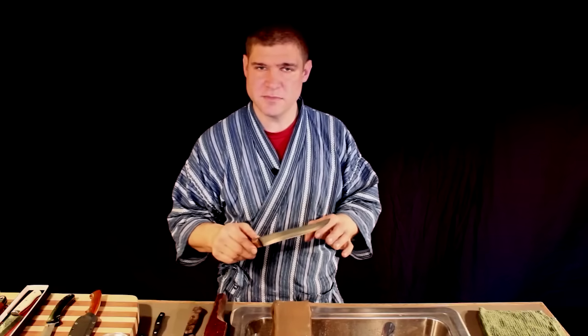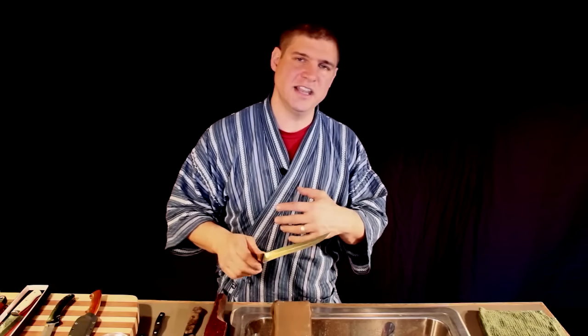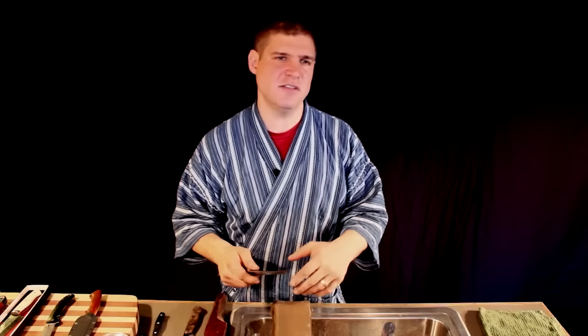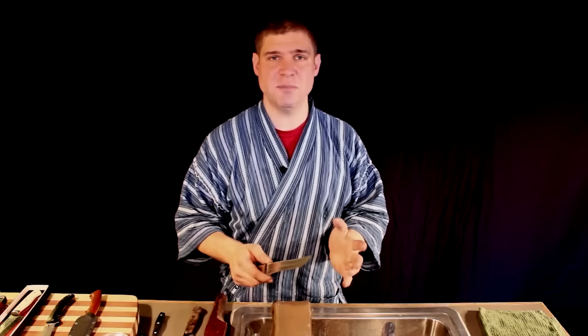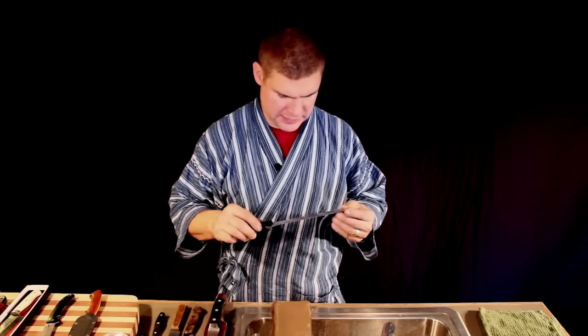Now, if they're minor chips, you can just be assured that with repeated sharpenings, you'll eventually get the chips out. So you might not feel like you need to get the chips out in just one session of sharpening. You might think, well, by the time I've sharpened this blade the third time, they'll be gone. In the case of really severe chips, where it's actually going to impede, for example, long slicing cuts, because things get caught up in that area where there's no cutting edge, you might need to spend 2 or 3 hours, over however long you want to divide that up into, to fully get that chip out. Another consideration is serrated blades.